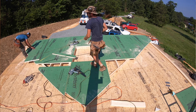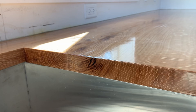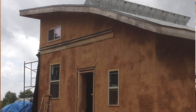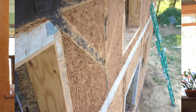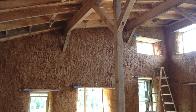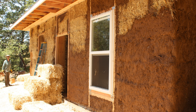We've built all kinds of high-performance conventional homes with insulation details that perform really well. We built an airtight home to the rigorous passive house requirement of less than a half an air change per hour — that's insane. We even built the first panelized hempcrete home in North America, and yet nothing excites me more than building with straw bales. In fact, I built my own house with straw bales, and I can attest to the strength, the thermal mass, and the amazing insulation value that keeps me cool in the summer and warm in the winter. Straw bales are basically rectangular bricks of insulation that you can stack to make a wall and literally just smear with mud to create a superior wall system — the closest things to Legos you can use to build your home.